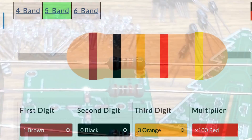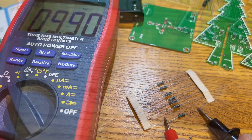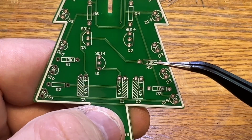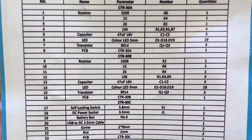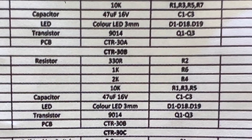The resistors in this kit came with the 5 color band method. But I find it easier just to measure them and then mark the paper with what value they are — it makes it easier to assemble. Some resistor values were marked on the boards but others were not, so I had to refer to the user manual. The user manual had really small print so I took a picture of it with my phone and zoomed in so I could actually read it.